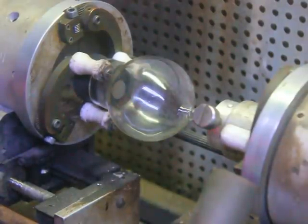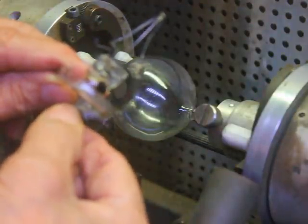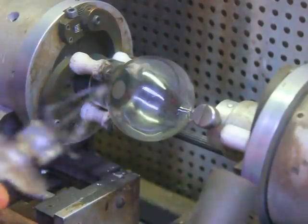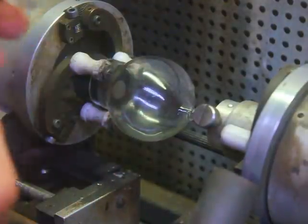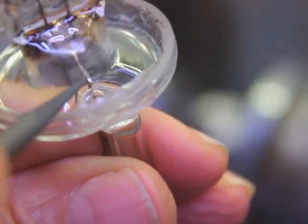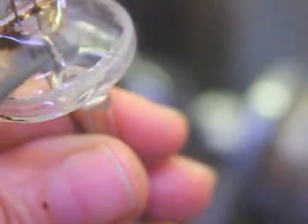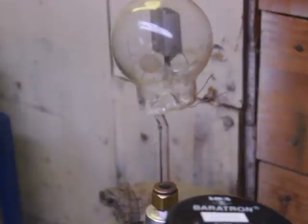The next thing to do is we have to make up the electrode — seven electrodes, but we only have two that go through: the filament. The plate and the grid go out the top, which makes it a little bit easier. We only have two seals to make, which makes it a little less likely to be bad. Which is why I don't understand this one leaking. Oh — I see it. I see it. Crack in the glass! That was a stress crack. Where we sealed this evacuation stem onto it, there's a crack that went up in there. That's where it was.